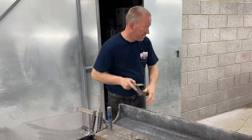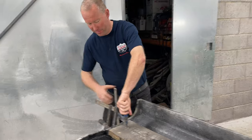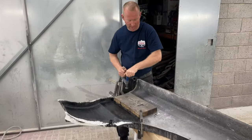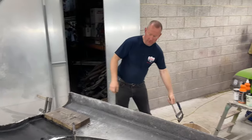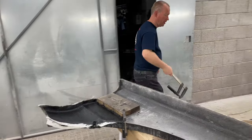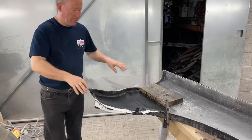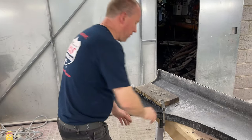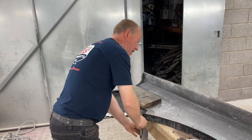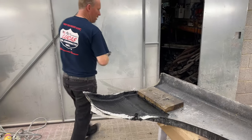All right, so it's the next day. We've left it overnight to dry. Now is the moment of truth to see what the repair looks like on the other side. Hopefully it's sat down nice and smooth. And we haven't got a huge mark. I'm hoping that we could just basically polish the little bit of the fiberglass and new gel coat we put on it. And then get Calvin in from BK Graphics just to put a wrap just on the bottom part of it.